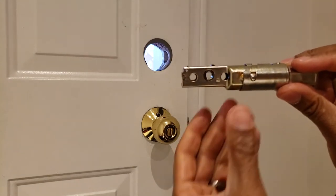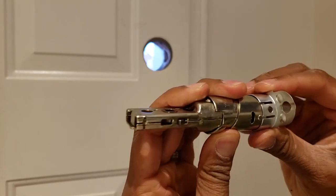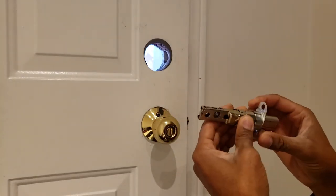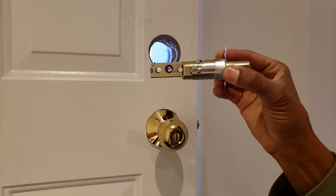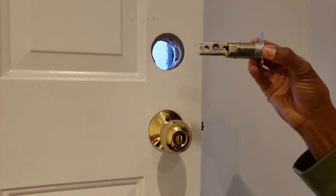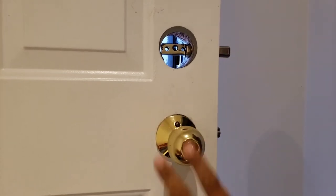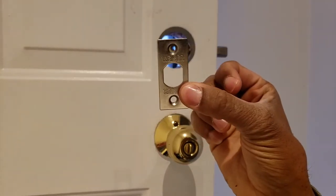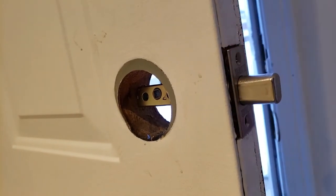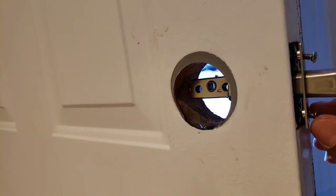Here's the latch for my new door lock. My door edge is chiseled, so I had to make sure I installed the back plate correctly. When you're installing it, make sure that raised circular piece fits right into the circular hole on the back plate — make sure it snaps in and it's snug. Also when you're installing the latch, make sure the curve is on the bottom side. Then find the necessary plate for the deadbolt and the two screws and go ahead and install it.